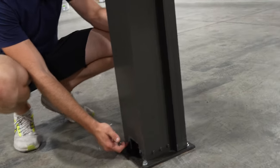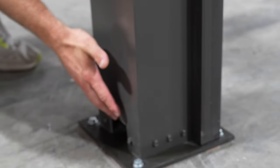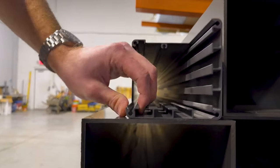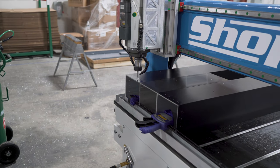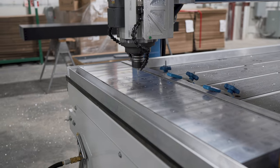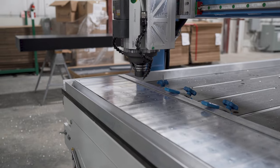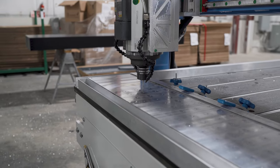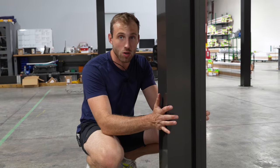The post base always has a drainage section to ensure an attractive way for water to come out. This is the drainage post — it's already notched; the other posts won't have a drain here. The post itself is also beefier than what you'd find in even our commercial industry. This is a 3/16-thick aluminum extrusion — 6063-T6, or aircraft-grade aluminum — and you'll find that in everything on the system: posts, beams, gutters, and even the louvers, which weigh about 23 pounds each on a 12-foot louver. A 12 by 16 unit is around 1,800 pounds, and that's where a lot of structural strength comes from.